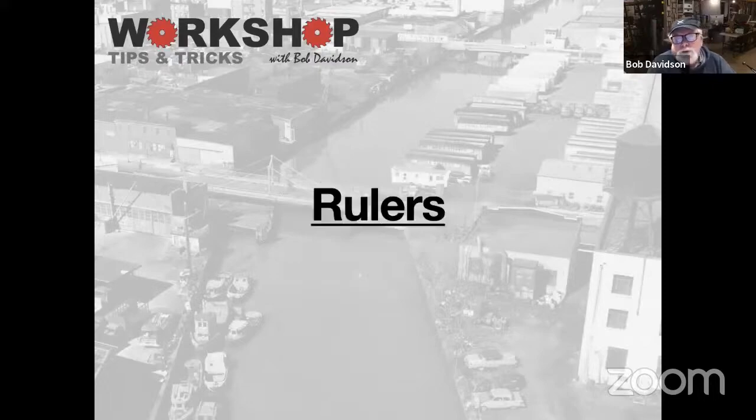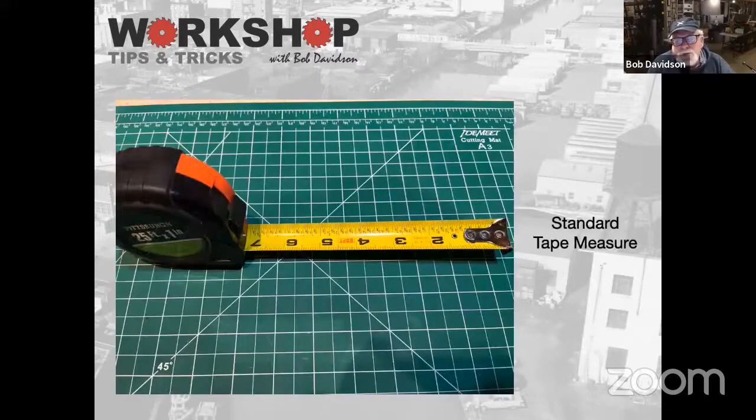So first we're going to look at rulers, and really there's two kinds that we use. We use tape measures. This is a standard tape measure. I love Harbor Freight because they used to give things away for free, and we all know how we all feel about free. One thing with a tape measure to be aware of is the little piece on the end. Those are riveted in, and they move. They're designed to move because of the thickness of the hook, whether you're hooking it over the end of a board or sticking it inside a dimension. And frankly, it's not terribly accurate on any tape measure.